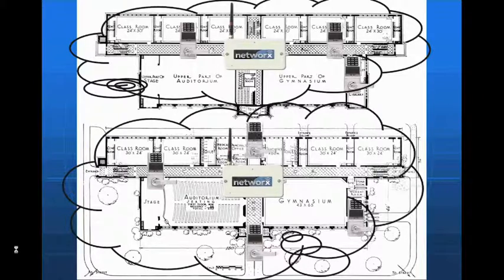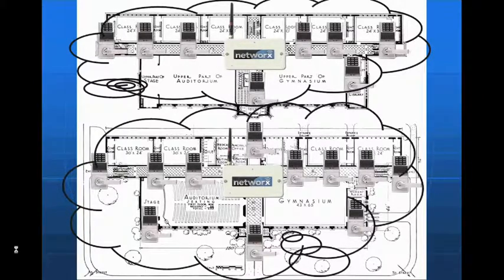The thing to keep in mind with the gateways is that they project a horizontal signal. So in multi-story buildings, you want to make sure that you have gateways on every single floor. You want to make sure that you locate the locks within that 200-foot radius. You can simply add more gateways, up to 50 of them on one account.